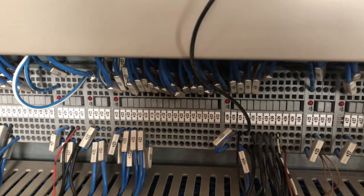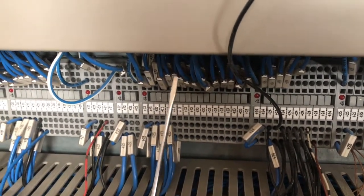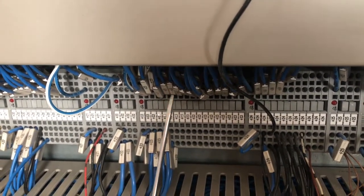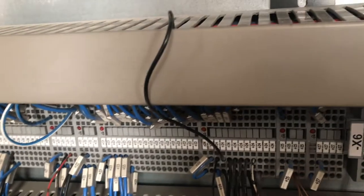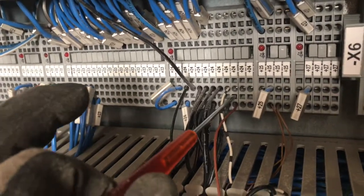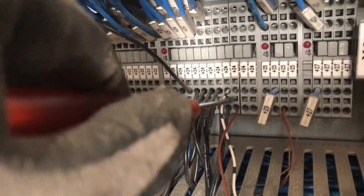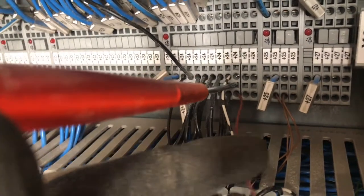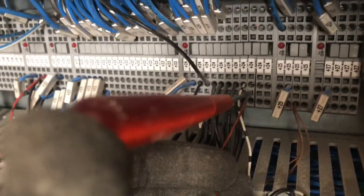When you're installing wires in terminal blocks, you'll want to use a small, straight-bladed screwdriver. See how the sides of the screwdriver don't flare out much from the tip down to where it meets the shaft — it's very helpful for these terminal blocks. To open up the terminal block, slide the screwdriver in along the top of the square hole. Once you meet some resistance, push and you'll feel a little click. Then pry and the wire will come loose. Pull that wire right out. Same thing for putting a wire in — you can put it right back in once you pry it up.